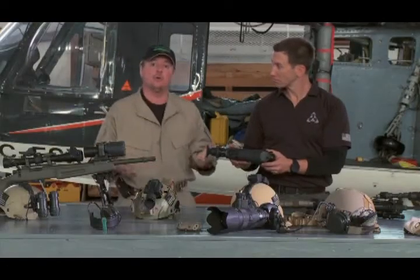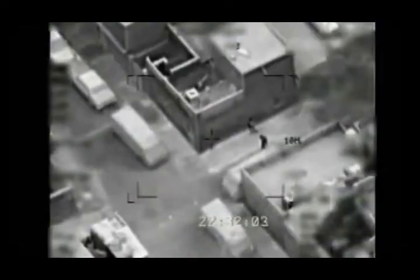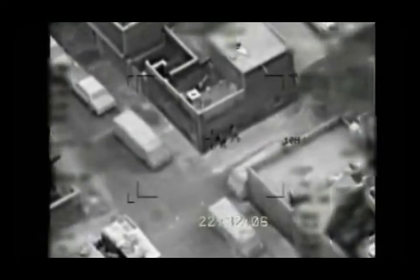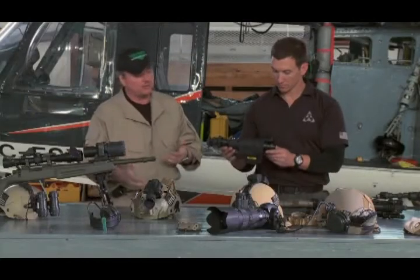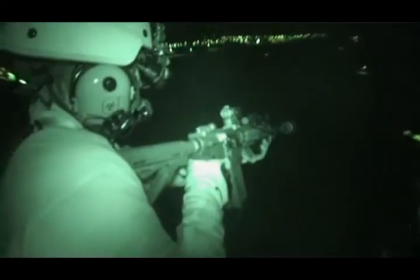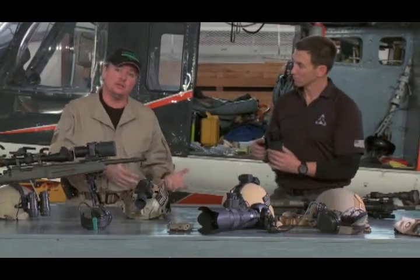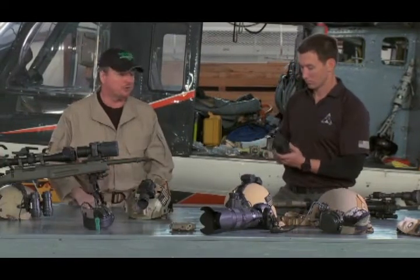The advantages, obviously, of thermal is they can see through fog or rain, where night vision basically would be rendered useless. Fire departments, of course, love the technology. Through smoke, fog, and rain, they can use thermal. Some of the disadvantages of thermal versus night vision is that there is much more resolution with night vision. Thermal devices see heat. They don't get the good facial recognition that a normal Gen 3 intensifier tube night vision will see. Therefore, night vision gives better target identification and suspect identification on the ground for you as well as your ground folks. So either way, both systems can work in combination to give you a great deal of view and a great deal of advantage out there in the field when you're working these operations.